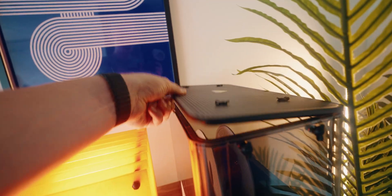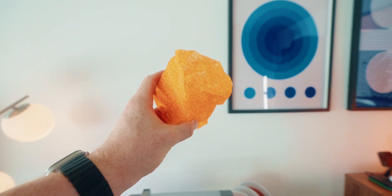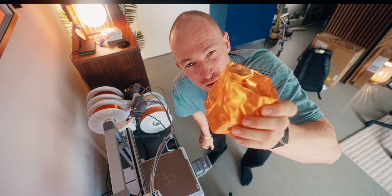I also thought that maybe my filament absorbed too much water, so I dried it for about 12 hours, but that didn't change anything — still another fail. From my research — basically just one Reddit post I could find on the topic — I really have to slow the printer down by limiting the max volumetric flow in the filament settings. It was supposed to be 17, which was the normal setting. I put it down to 11 and thought that was pretty slow, but it's still not working. So I'm just going to go really slow and put that to maybe 3, and see what happens. Finally, the print worked and those are some thick layer lines. The trick really was just slowing it down, but I want to go even thicker.